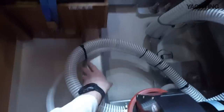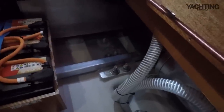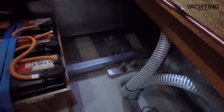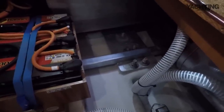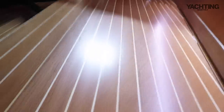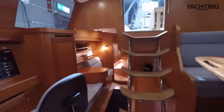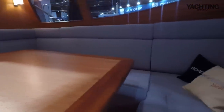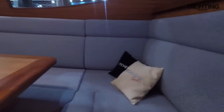And then underneath this, you can see these big galvanized steel girders, and they connect onto the keel to spread the keel load around. This is an incredibly stiff boat, so all of the calculations for stiffness are done basically not taking the steel into account. They then add in these steel girders, making it even stiffer. It's a traditionally built boat, so it's hand laid up really thoroughly by proper boat builders. So this boat structurally is hand laminate, incredibly strong, built by hand rather than vacuum infusion. So they've gone for strength over necessarily weight saving.